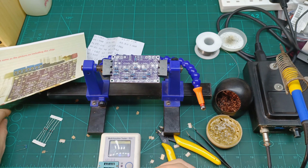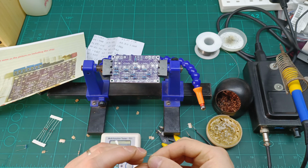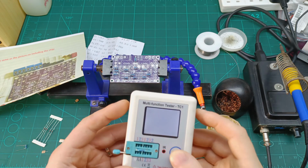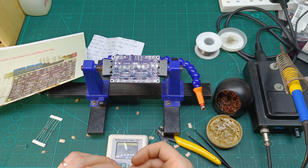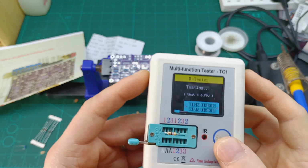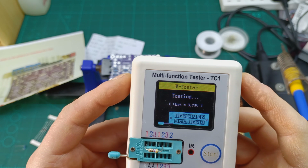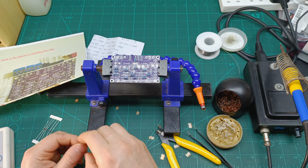And then I look in my stock, I couldn't find 560, I find the 510, which this one should be 510. So this is 511, and I have also another, the 47 ohm. So 47 ohm plus 510, it's almost 560. So if I have these two in series, I'm gonna make 560 ohm, definitely. Yeah, 47 ohm plus 511, I'm almost there. So let me put this one in series and insert over there.